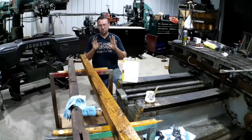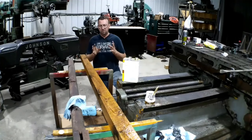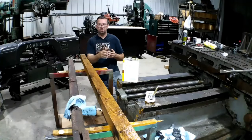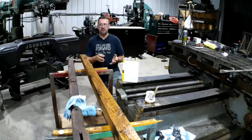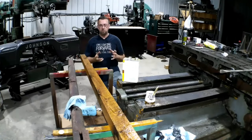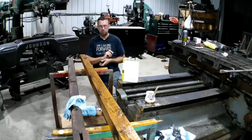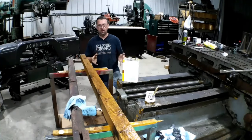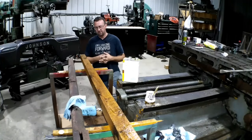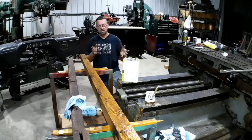This is where it gets pretty cool. That first coat went on good, and after a couple of days it soaked right in. Every coat after that — as you brush it on you can see the dry spots because it just draws the oil right in, and you've got to keep going over it. This thing will take a lot of linseed oil and soak it in 100%. The beams on the water wagon are 10-foot four-by-eights, and between the two of them they've got three gallons of boiled linseed oil — preserved from the inside out, soaked through. That wagon is going to last a long time, and this tongue should last just as long.